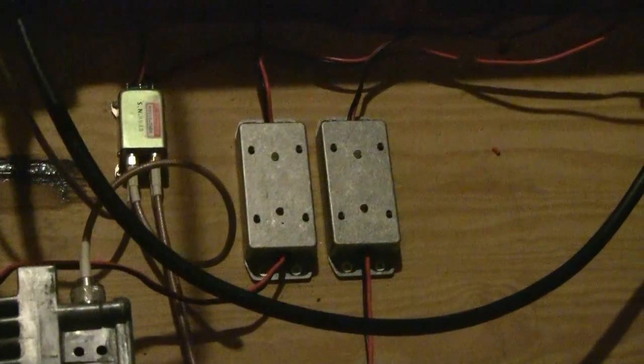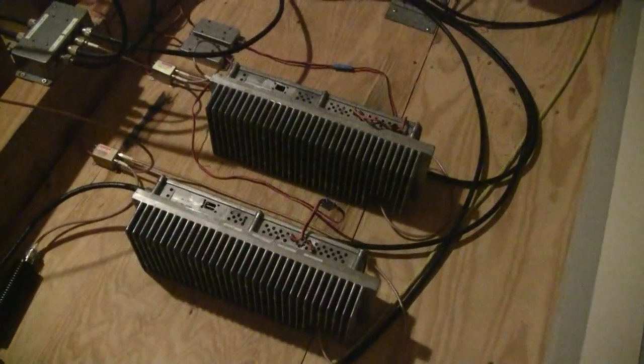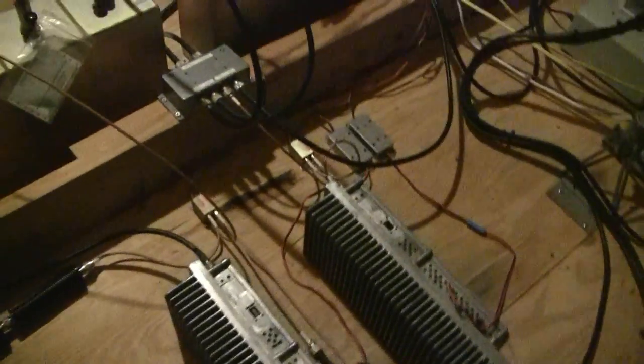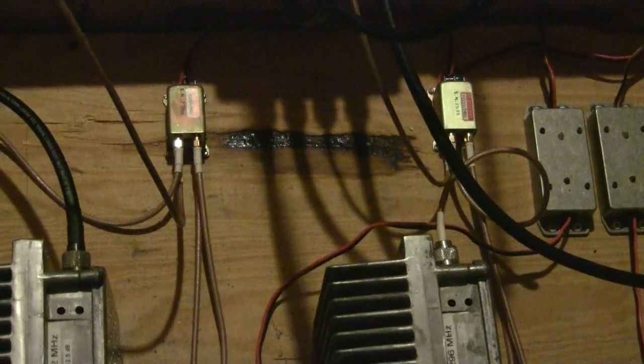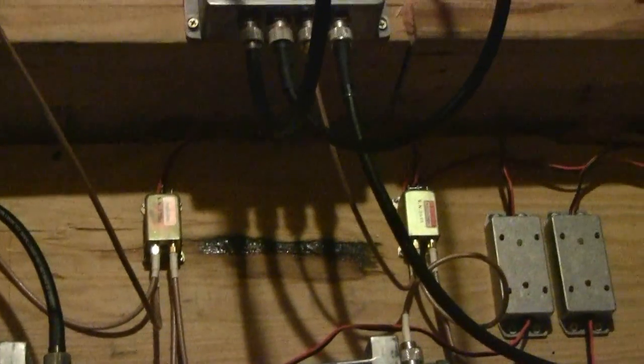On the floor, these two small boxes are for power sequencing. When I switch on the 1296 or 902 LNA-PA combo, I have a bypass switch for each one. When it initially comes up before it gets switched in line, I don't want the input and output talking, so I delay the power-up of the amplifier to get those transfer relays set.